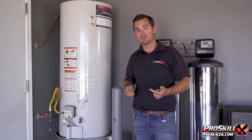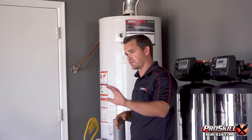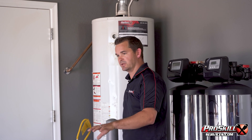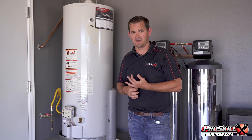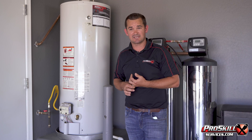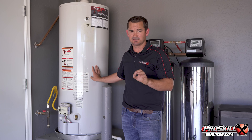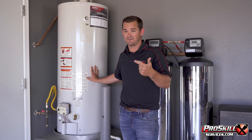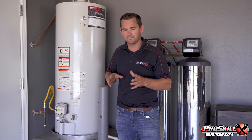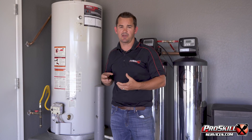The second thing we can do to prolong the life of the water heater is flush it. As the anode rod breaks down and sediment gets brought in through the pipes from the main, that sediment can build up at the bottom of the heater. Your efficiency can drop, and a lot of times people will hear a popcorn kernel sound at the bottom of their heater — that means you've got a lot of sediment, and typically rust as well. To flush the heater, all you need is a hose and typically a flathead screwdriver, or sometimes your valve will have a knob on it.